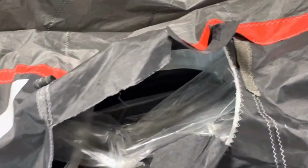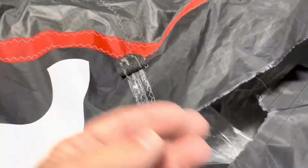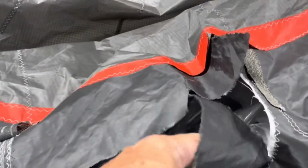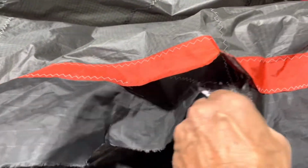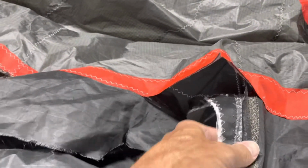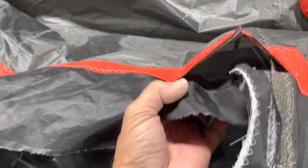Then the next step is figuring out what you've got to take apart. So you have to open up the leading edge. You have to remove pads. These are all coming back. Now we get this all clean all the way out to every one of the repairs, the rips. It went into the cell a little bit, so we had to remove the cell. This pad has been loosened up and will be moved back. So now that we can get in here with a good 1.5 to 2 inches of grab on this material back in here for repair and put it back together.